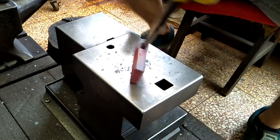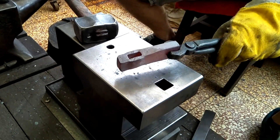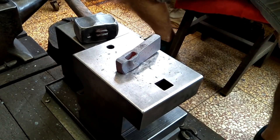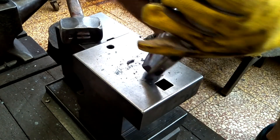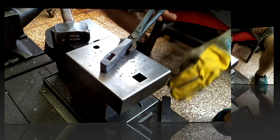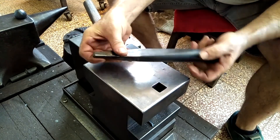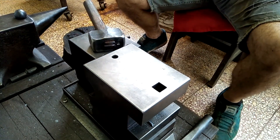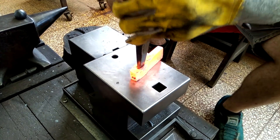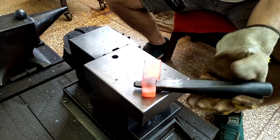This very thin punch is a good second tool to use for this sort of operation. I don't really want to remove any material, but if your cutter is not aligned perfectly from both sides then you might have to remove a small slug, as you can see there. I'm getting on to progressively wider punches as I go along — I only show myself using these handheld punches from one side, but in fact I'm doing it both top and bottom.